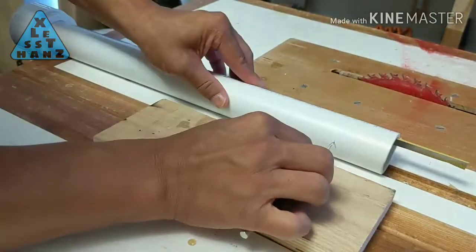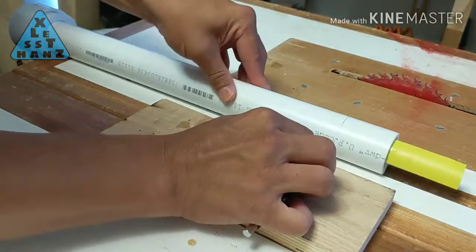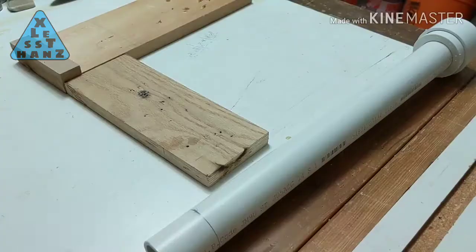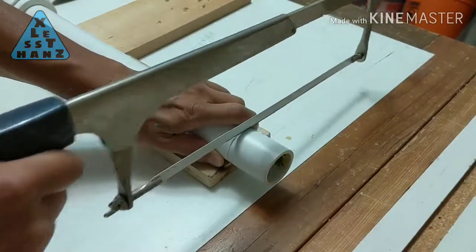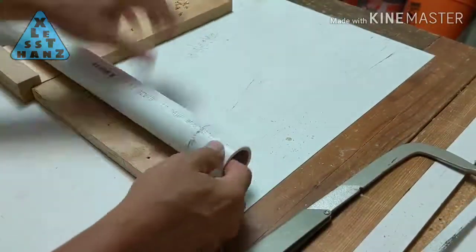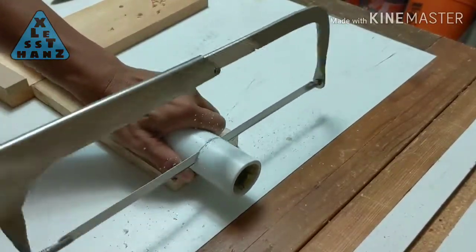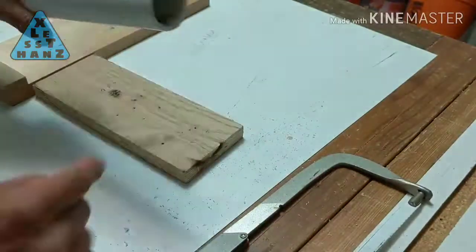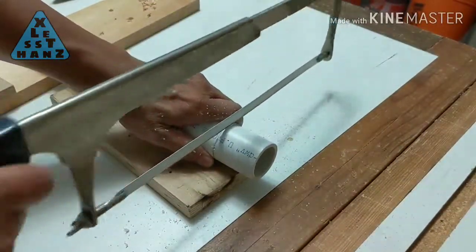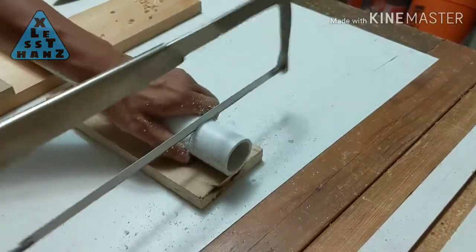Carry this mark around the circumference of the PVC so you'll know what a straight cut should look like. Cut the PVC, staying on the line as much as possible. The reason you want this cut to follow the line is because if the battery compartment edge is crooked or slanted when the circle is pressed against it, the circle could bend. This would prevent completing the circuit at a later time as the circle repositions itself periodically from turning the flashlight on and off.